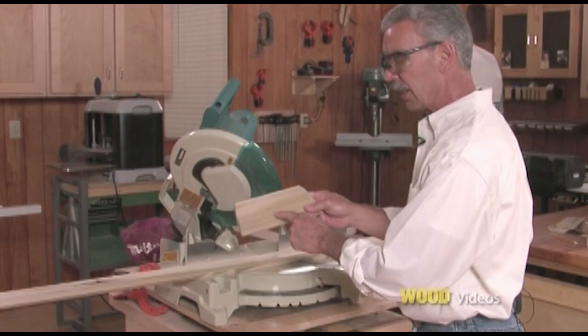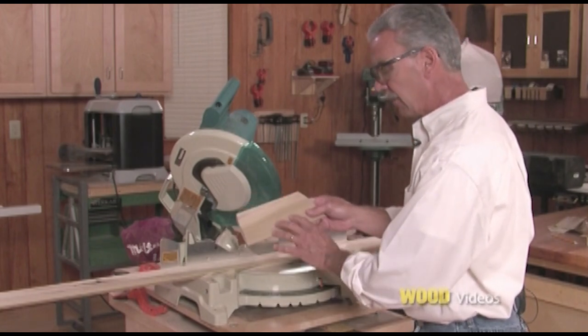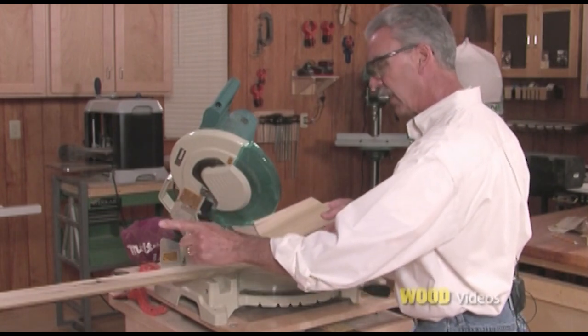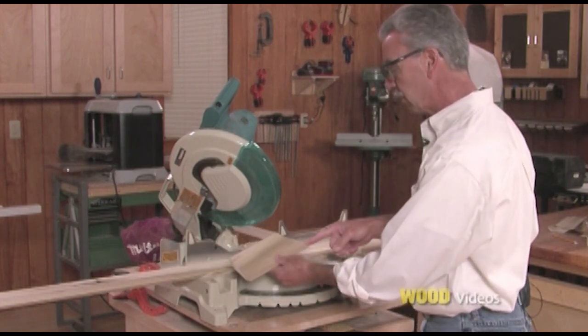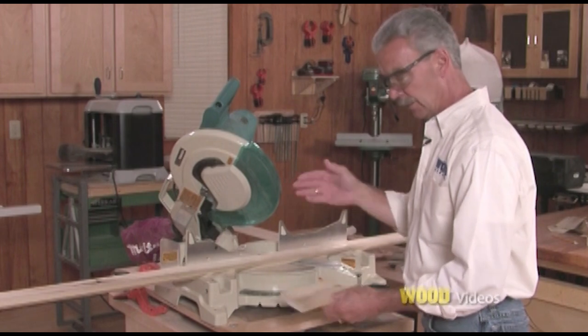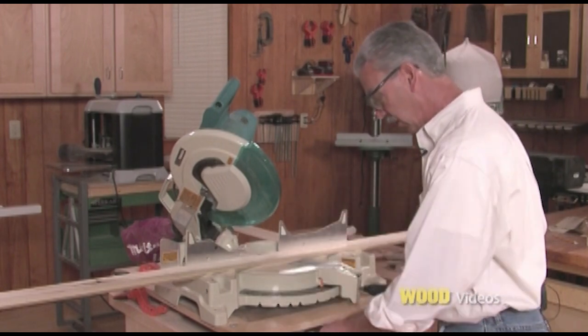And again, I like to add about a 32nd of an inch just to provide a little tension on that cut. Now that I've got it here, I measure from the outside end that I previously cut to the position on the trim here where the new cut's going to be made, and I have all of it done for me. It really makes using these templates simple. So we have 32 1/16 of an inch